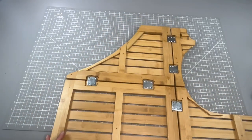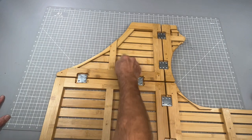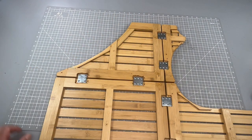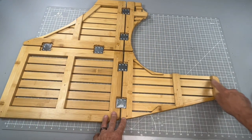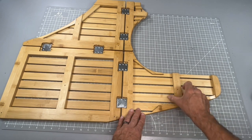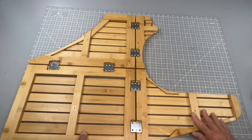When you take the big bite out of the panel, you've got these pieces sticking out just kind of flopping around. So I used some of the excess bamboo parts, cut some pieces that fit in there, epoxied them in, and then recut the curve when done. I made a cardboard template of the whole area using taped-together old Amazon boxes — pretty easy. On the more heavily cut pieces, I glued a piece here and here, and one of these thicker pieces at the end to keep those pieces from flopping.